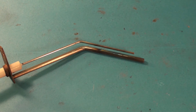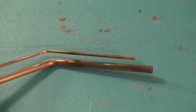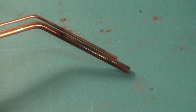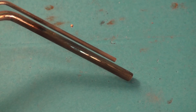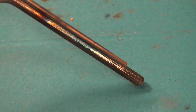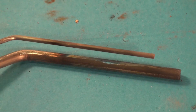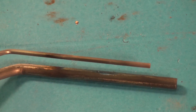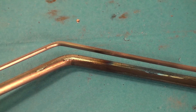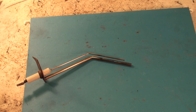This is what they came up with when they couldn't get the hot surface igniter to prove flame well. Looks like this one somebody tried to clean. I don't know why the furnace was taken out, probably just because it's a pretty ugly old furnace. Anyway, that's how that flame rod was set up — clean it like any other flame rod.